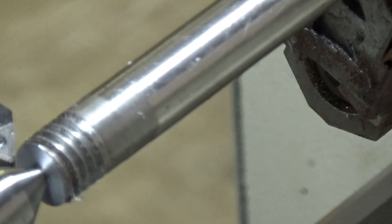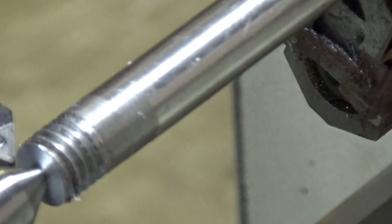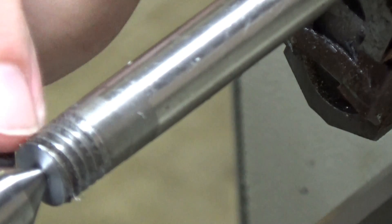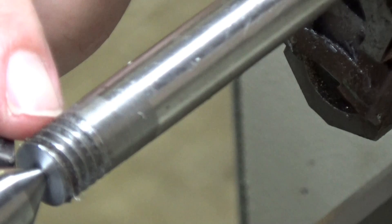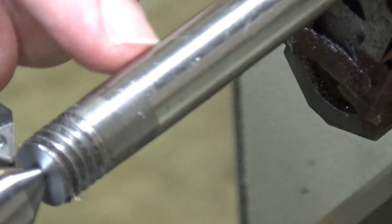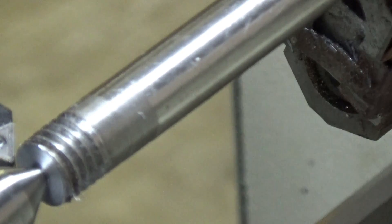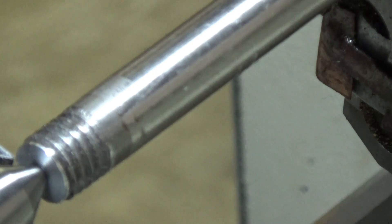This next part, we're going to be making the screw for the up-and-down feed control. I'll do a little sketch: 400 thousandths for the threads, 1.250 for the body, and then about 150 thousandths for the head. I'll lay that out now and make sure the feed is going the right way.